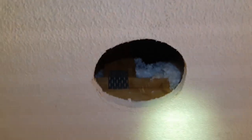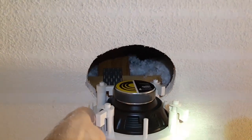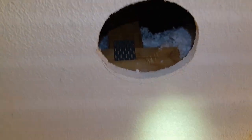I get a question sometimes: can you put ceiling speakers right up to a stud? As you can see, pretty much right up to a stud - I'm touching the stud right there with my finger. The answer is yes, you can. You don't want one of the clips up against that area; you want to straddle it so it'll clip on the sides of it. Yes, you can put a ceiling speaker right up to a truss.